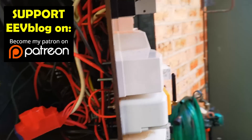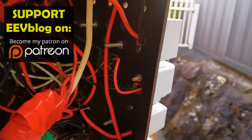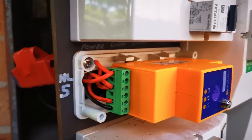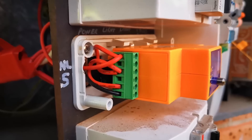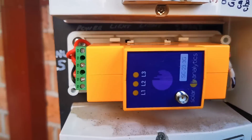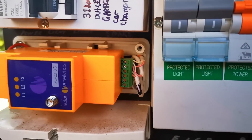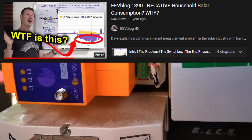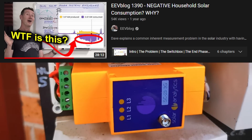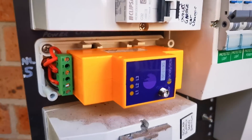I can show you on the back here — that's the wire there that's powering it. If I get the cover off, there's the mains input over there. Nothing looks like it's come out or anything. It's got a phoenix block. There's the other side with the current transformers — I'm actually paralleling them up, I've done a video on that. Let's measure the voltages on there and see if we're actually getting mains input.